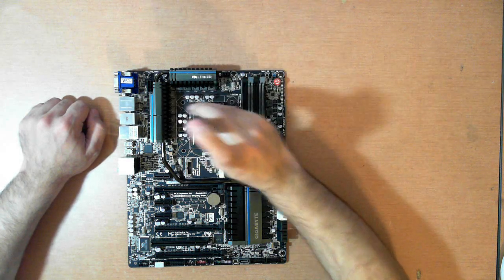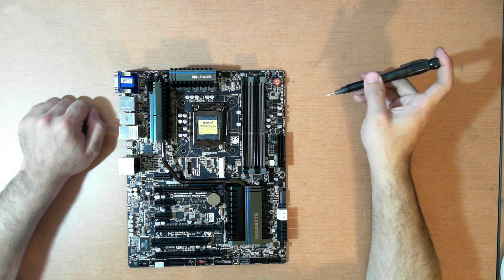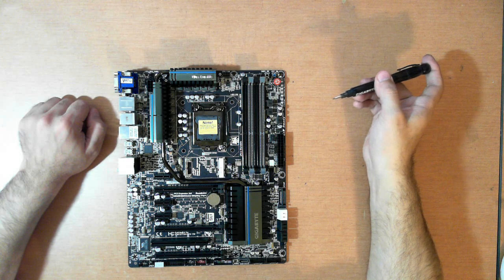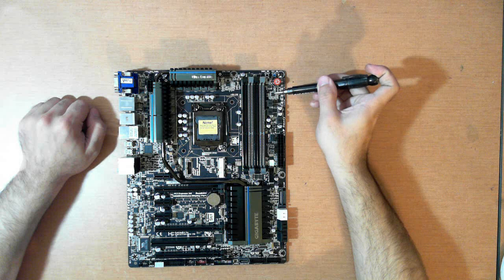This is like ROG style, okay? ROG is the only other brand that I know usually uses 8, except in the lower end. Like if you're paying less than like $250 for a ROG board, you're probably not going to get 8 true phases. However, then we have a dual output PWM here.